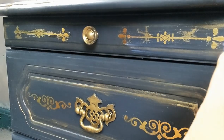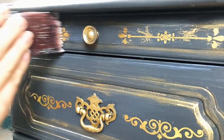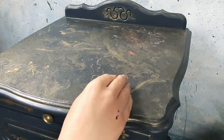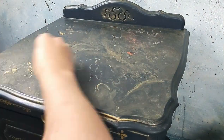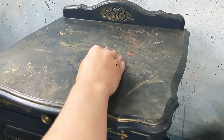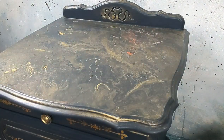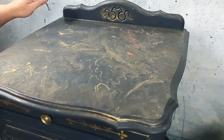The top coat does have a bit of a blue glare to it as you apply it, but as soon as it dries it will dry clear and self-level. Now that the gloss has dried on top of the piece you can see there's some shimmer and reflection to it. I just want to buff it a little bit more to add a little more sheen, because I really want this piece to look a little bit like marble. I've got some fine wire wool and I'm just gently buffing over the top to make the piece a little bit more shiny. Thanks so much for watching — remember to give the video a like, a comment, and a subscribe!